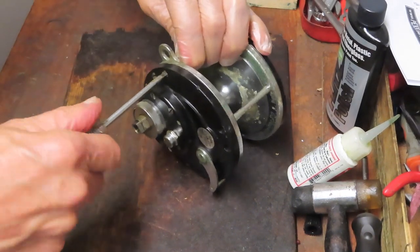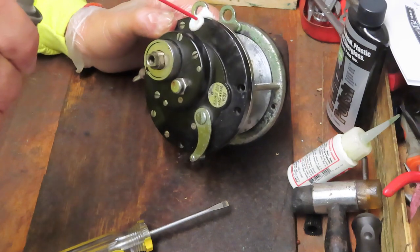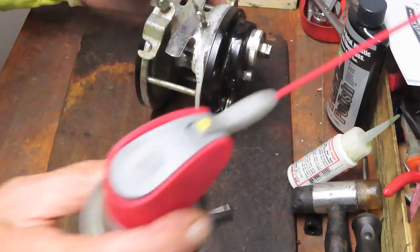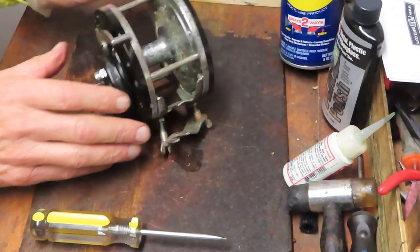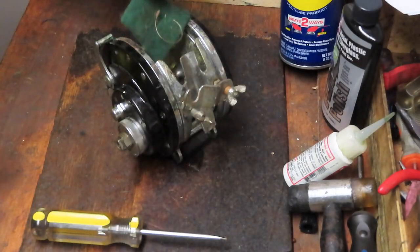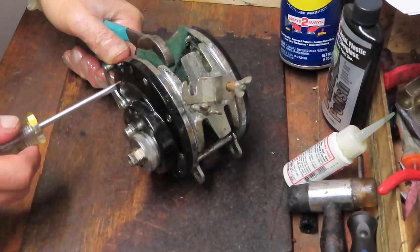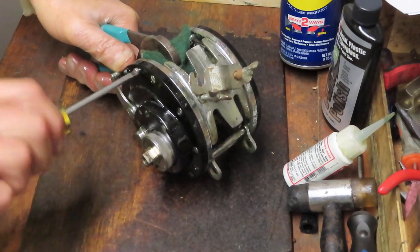We're going to see which ones we can get off. Here's a little trick I've shared before - if you get a stuck screw, grab a scrubby or a piece of steel wool, wrap it around the bar so that you don't scar it, and use something like channel lock pliers to grip it. But again, you want to protect it so you don't rip up the chrome plating. Then you can stop the spin of the bar and remove the screw.